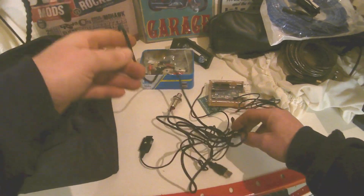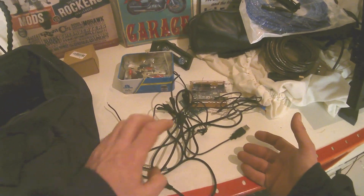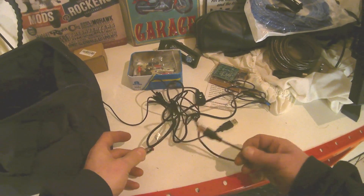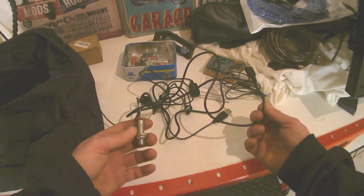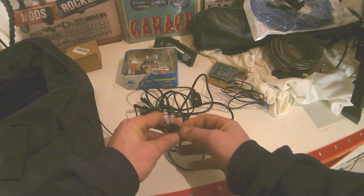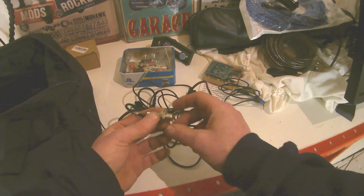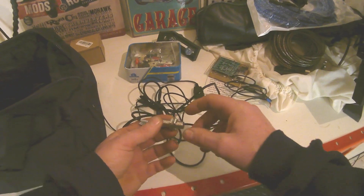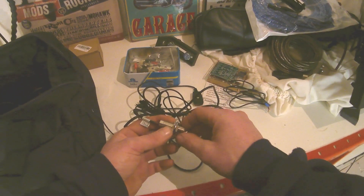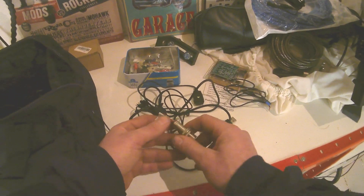This is a rough wire of what I've made up - it's got a charger cable wired in. The sensor runs off five volts, as does anything on the Arduino. The best five-volt source is USB, like battery chargers. We've got this wired up so you can just click it into the back of the PC - it takes a five-volt supply and every time it reaches a signal it flashes. This is a cheap eBay Hall pickup sensor. You could use a proper Bosch one, and Alex on Two-Stroke Stuffing did name the proper brand, but I've had it working off this.